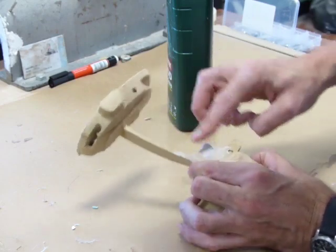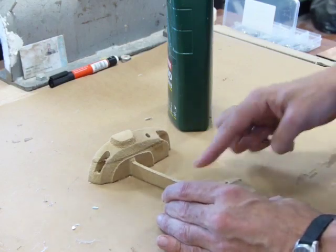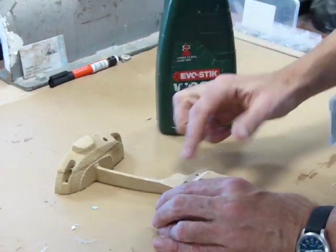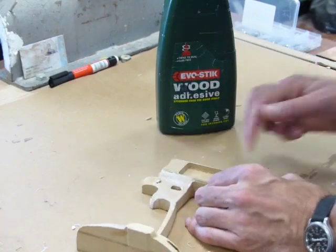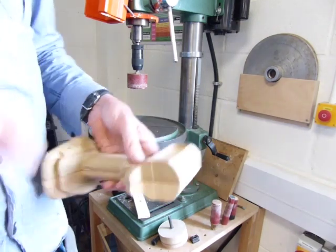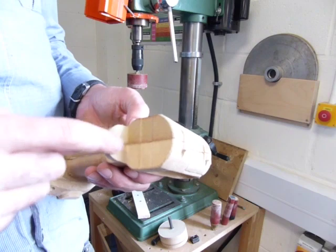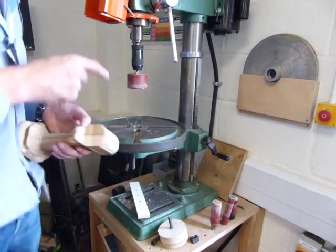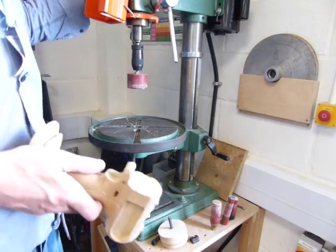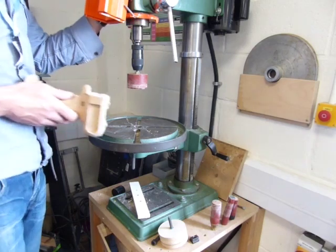We've got another product called sanding sealer. It's the same kind of purpose, it will just block the pores of the MDF. You will need to apply a few coats of it as well to get the same effect. So some bits the CNC router, as I mentioned, won't be able to do, the overhangs. This bit in here is going to be an issue, so I'm going to just use the bobbin sander without the jig underneath. Just be able to sand that down so I can get the round clutch on it.